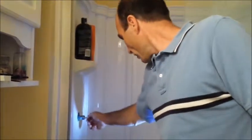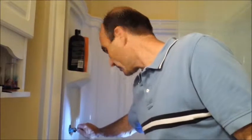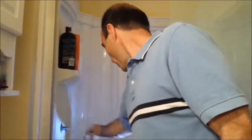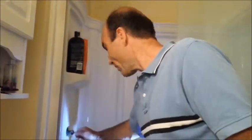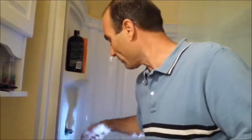If you pull it on, you're getting warm water. You want to turn it to the right. It should be colder. Right now, that's getting hotter. I just turned it to the right, so it's getting hotter. That tells me I'm upside down. So now I'm going back to the middle. It's warm. Now I turn it this way. It's getting colder. Bring it toward you. Now it's getting hotter. So now I know I'm right. So now we know that's right side up. If you get it wrong and you're backwards, just take the handle off, flip the cartridge over, and put the handle back on. That's all you have to do.